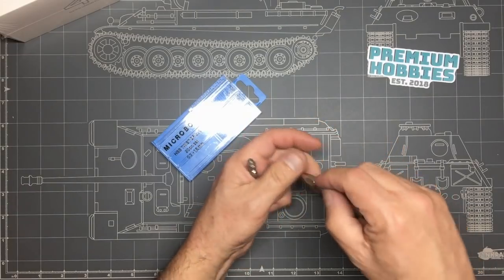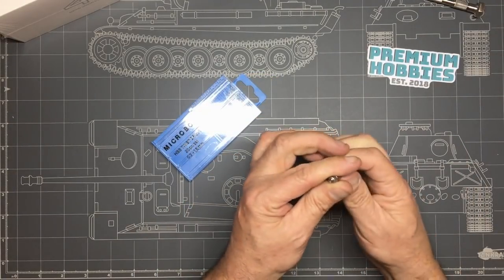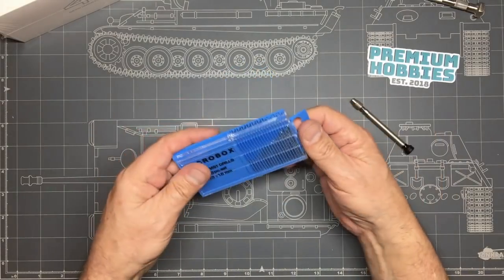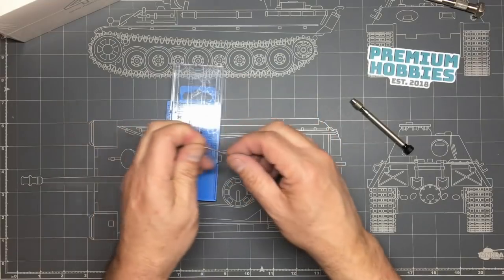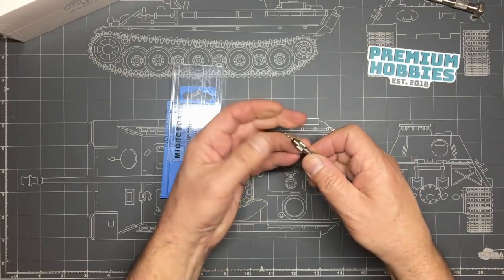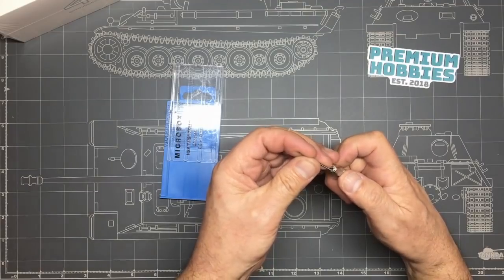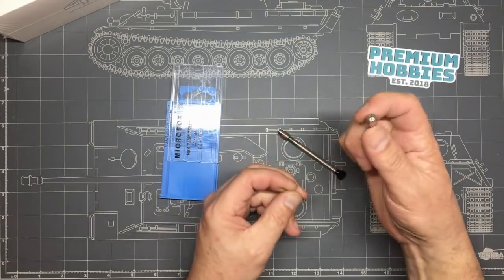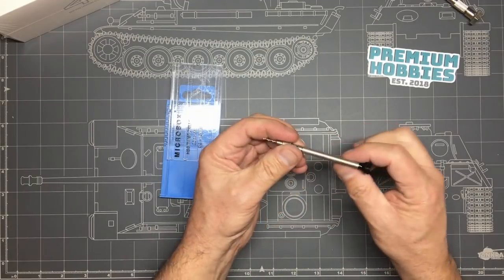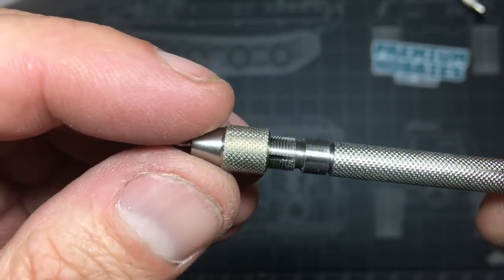For instance, if you're drilling portholes out in the Titanic, you might go from 1mm to 1.2mm — with this you can just do it, but with the other you need to change collets. This will go from 0.1mm; I've just done some drilling with a 0.3mm drill and it was lovely. It'll go all the way up without changing any collets. I'll show you — here's a 1.2mm drill and that goes straight in and grips it. It's also got a very nice knurled locking ring and a knurled handle for grip, and the top here spins.